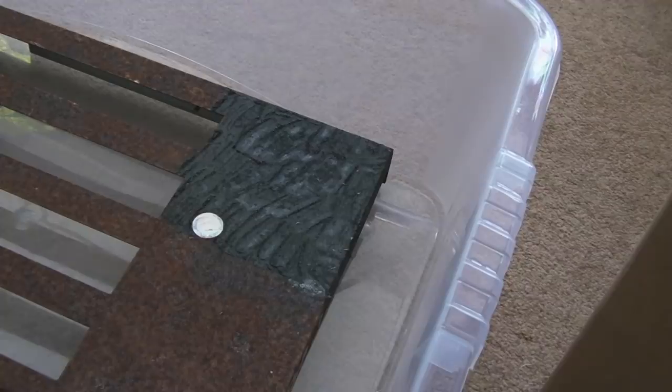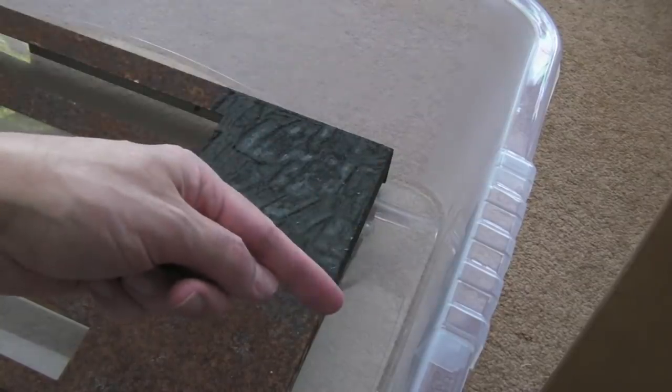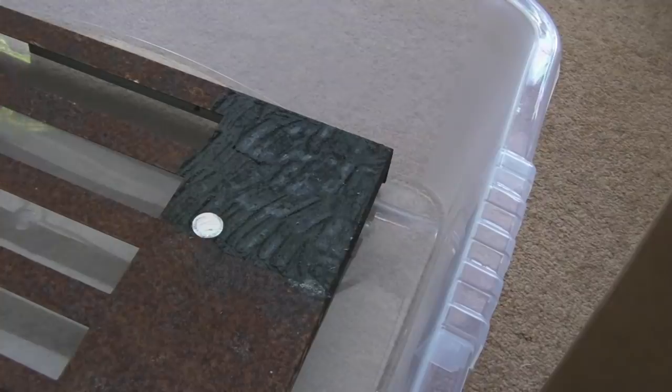Once we've done that, I think what I'm going to do is, I've got some zinc as well, and we can use that same process. Instead of using a steel rod there, we can use the zinc rod, and we can zinc plate it. Now zinc's kind of a dull metal, so it won't be very shiny. Nickel might be a better candidate for something like this, but I just want it to be rust proof, and zinc is effectively rust proof.